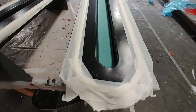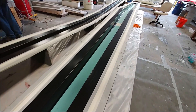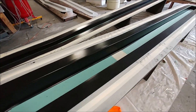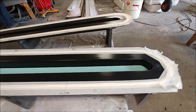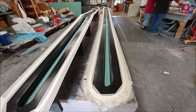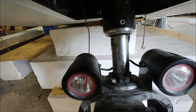Jeff and Devin got the core cut, and there are a couple of FR4 hardpoints in there for where the foreplane gets bolted into the fuselage. Those two molds are all prepped and everything is marked out. Last time you may remember Jim was laying out the cabling for the aileron controls.